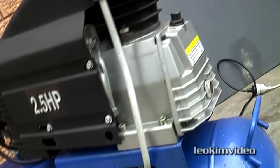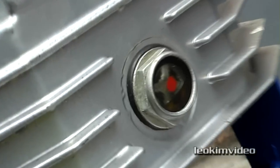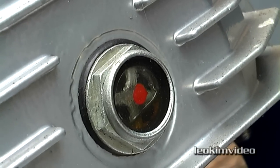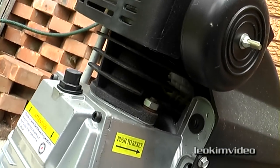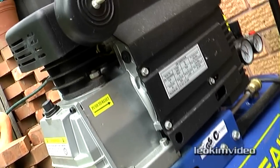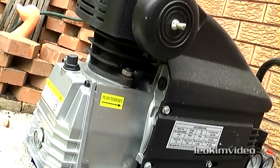There'd be one thing I'd note about it — it had been weeping a bit of oil, and you can see the mark of it going down there. It certainly has oil. Although they say to keep the oil up to the red mark. One notable thing was just before it failed, it was making some very labored sounds — it seemed like it was struggling to push that piston to pump air. My gut feeling is it's a problem in here somewhere with the piston, but I've got to pull it apart to work out what's going on.